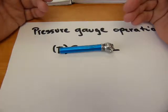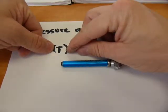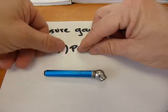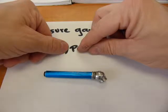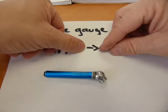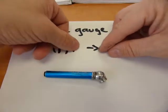Pressure cannot be directly measured — it can only be calculated. The force on the gas exerts a pressure, and this pressure moves either a diaphragm or a spring inside a pressure gauge, or a Bourdon tube, or some kind of mechanical device that is actually being forcefully moved and displaced. The amount of displacement or motion will be directly proportionate to the amount of input — the amount of pressure or force represented in the pressure.